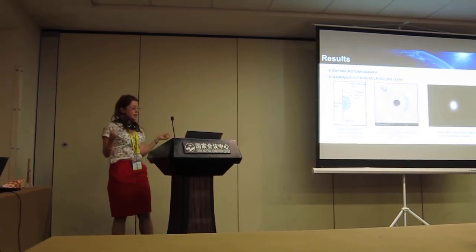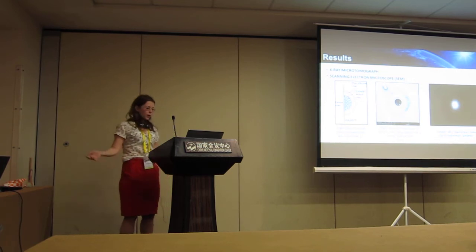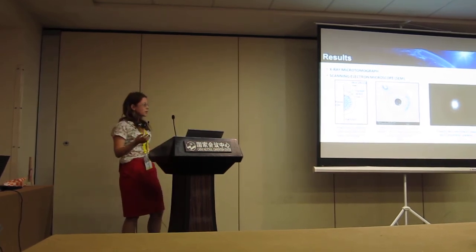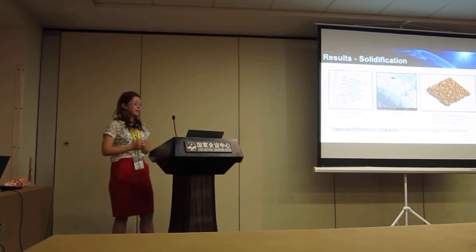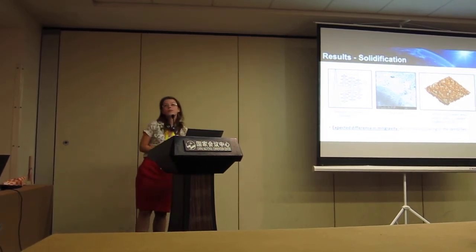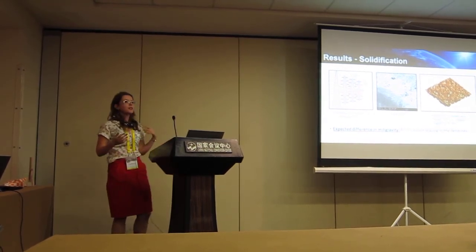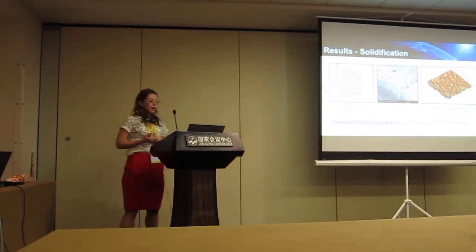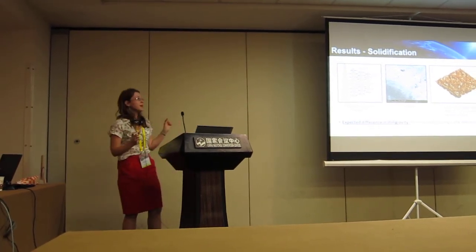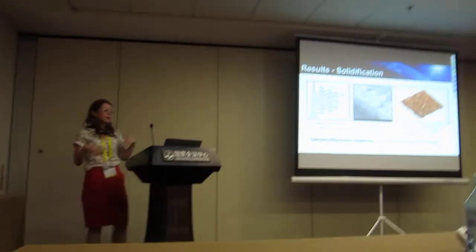We were interested in seeing the major microstructures after laser processing, so we compared the theoretical picture with what we obtained. Due to temperature gradients, we also observed micro-cracks on the sheets. For solidification, we analyzed the theoretical picture for dendritic growth. Branches, usually called dendrites, are formed due to variations in composition in the material. If solidification takes place rapidly, the primary spacing between the dendrites decreases, making the material stronger.